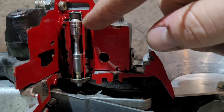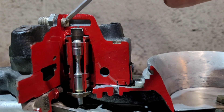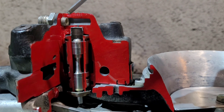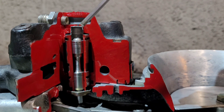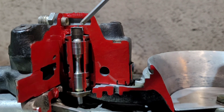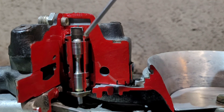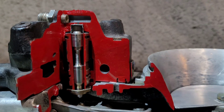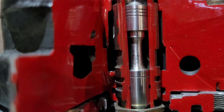As you see, the air flap goes up, moves the pin up, and then the pin comes back down. The fuel pressure that helps that pin go back down is this union here — and this will be covered in the next video, which is the warm-up regulator modification, showing how to make the K-Jet slightly more fruity. The fuel pressure sits in this chamber; there's a tiny hole where pressure comes in through a pin-prick hole on top. The more pressure there is, the more force is pushing that pin down; the less pressure, the more easily the fuel pin can raise up. There is a spring in there but I've taken it out for ease of demonstration.